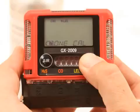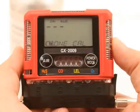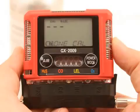The direction of adjustment is now reversed. Press and release the power mode button. The GX2009 will make the span adjustment and will return to the channel selection screen. The channel that was just span adjusted will be displayed. If you want to span adjust additional channels, repeat these steps for each channel while gas is still flowing. Make the reading adjustment right away since gas has been flowing for more than two minutes. If you need to calibrate more than two channels, use the AutoCal menu item to calibrate the GX2009.